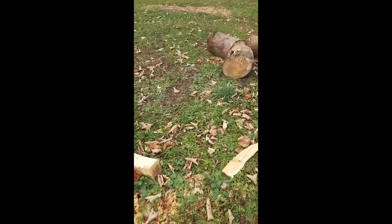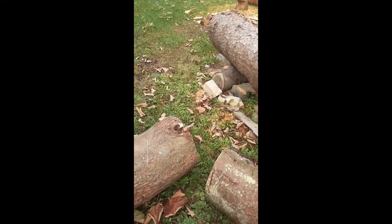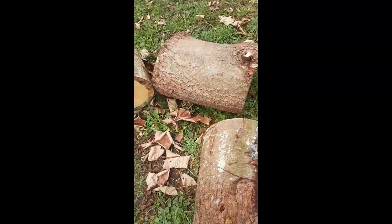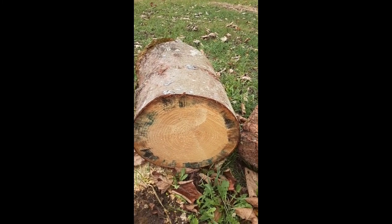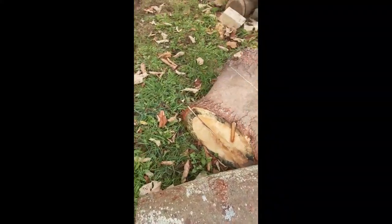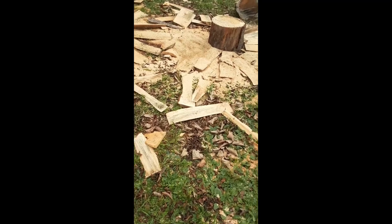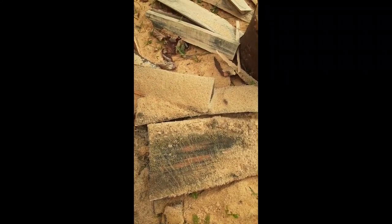You can get good green wood. This one here is a much healthier log, but the problem is when you leave them sitting on the ground they begin to develop problems. We're going to clean this one down — it has smaller beetle holes, sawyer beetle. It's starting to get the stain in it; that's actual black mold, that's not good. We just peel them down with the saw. You can see mold just proliferates, especially under sawdust.